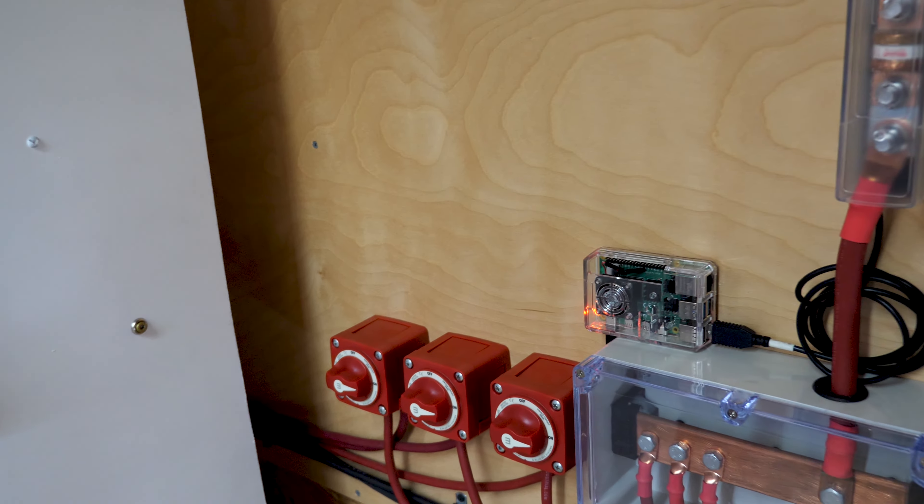I want to show you the wires and how it's hooked up to the entire system. There's a positive and negative that comes off the buck converter, and I'm running each side into the positive bus bar and negative bus bar. They're just running behind each of the end lines right here for the battery hookups. You may be able to see the cable behind there — you can see it a little better on the DC side, so I'm able to hide the power cables for the buck converter there. Coming out of the positive line, I do have a small inline fuse just to protect that wire and the components.